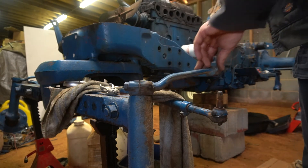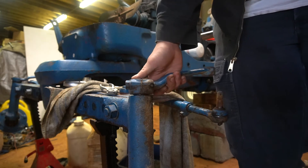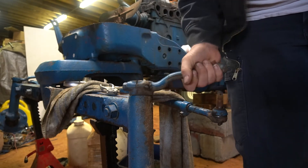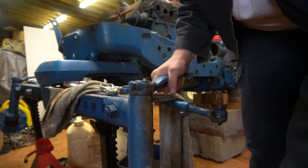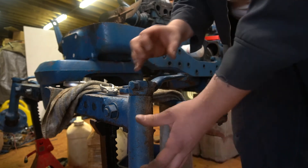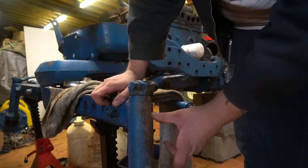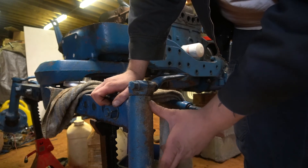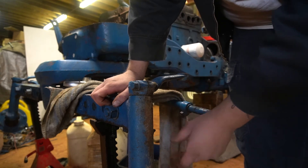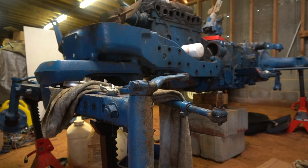Okay, so now our spindle is completely loose. There's a lot of up and down play which, when the tractor's on the ground, isn't really going to hurt you much. But there's a lot of lateral play — the spindle actually moving in the knee. There's a bushing here and a bushing here. On probably your '53 up to at least the '64s these are the same bushing. These are different on other models. The '65 is probably a different bushing but I'm not sure because I haven't messed with one of them.